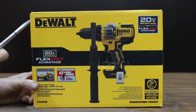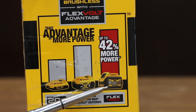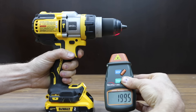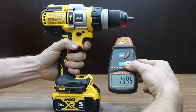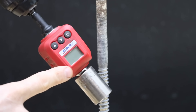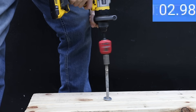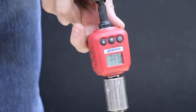A hammer drill has higher energy demands compared to an impact driver, so let's do some testing with the DeWalt 999B, which claims to produce 42% more power with a FlexVolt battery. All batteries are recharged. No-load RPM was nearly identical across all three: 1,996 RPM for the 2Ah, 1,997 for the PowerStack, and 1,996 for the 5Ah. With the drill in first gear driving a 12-inch lag bolt, the 2Ah battery caused the drill to lose RPM almost immediately and gave up at 6.38 seconds, producing only 311 inch-pounds of torque.